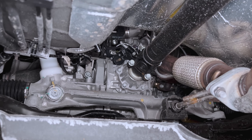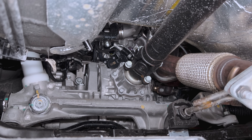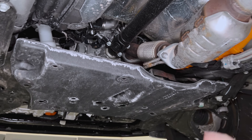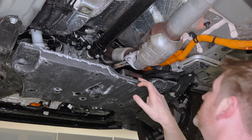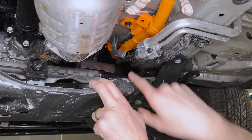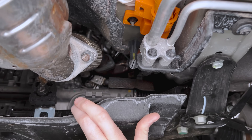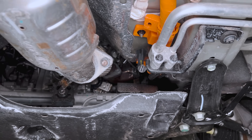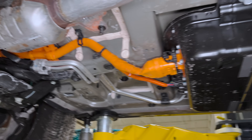When you start piggybacking two vehicle powertrain styles together, you often end up with this — just trying to package everything you need. It's the EGR cooler on this side. They are bringing power to the rear through a prop shaft and conventional rear differential. It does look like they may have a pump or viscous actuator so they can disengage and re-engage the rear differential.